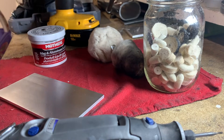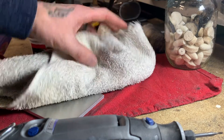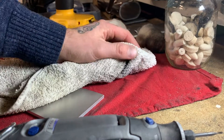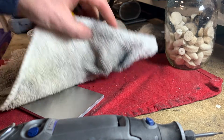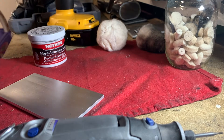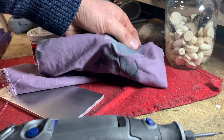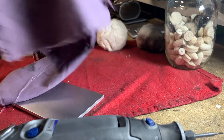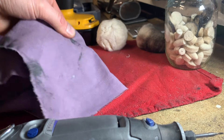If you are going to go by hand, you want to make sure that you're using a proper rag. Something like a piece of an old towel is actually pretty coarse, and believe it or not, it will scratch your material. What I've found to be the best stuff, at least kicking around the house, is like an old piece of a pillowcase. This stuff is way smoother — you're going to get a much more uniform grain and you won't affect any of the grain when you start to polish it. So I recommend something like that.